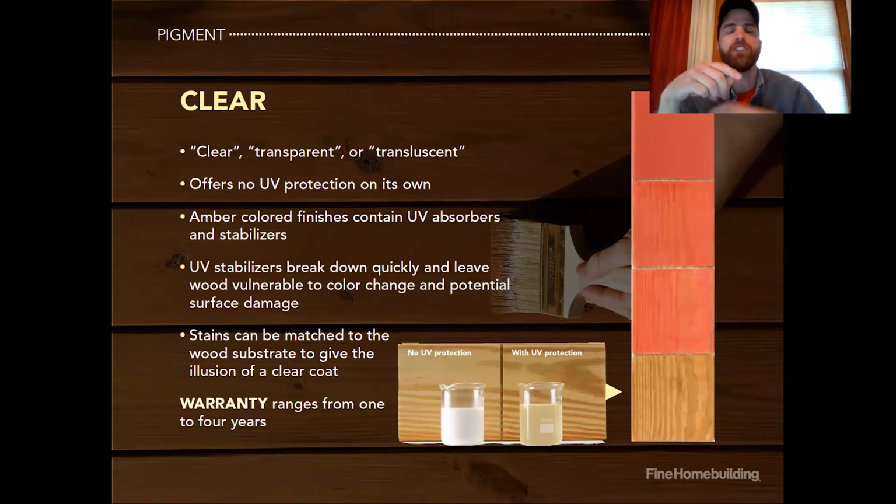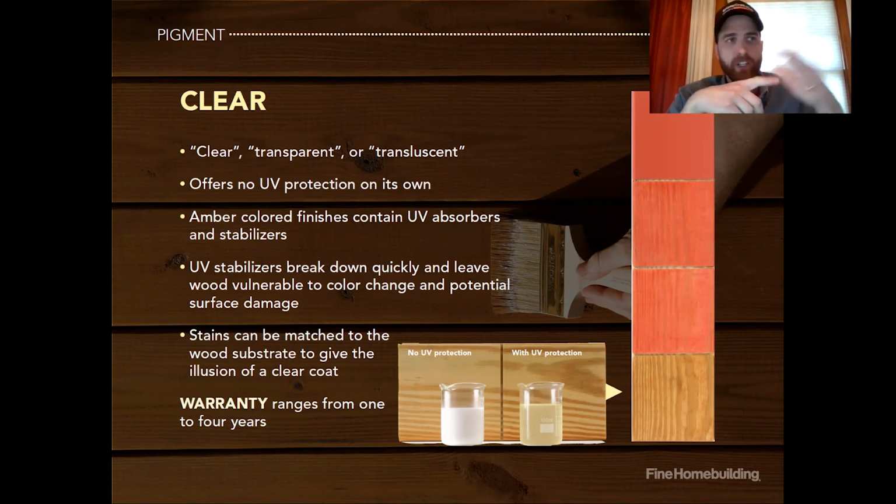So again, I mentioned no gutter downspouts pouring water under your deck. You don't want to have drainage from one part of your yard running down under your deck before it goes into the woods. You want to make sure you don't have grass and weeds and dirt. You want to make sure you have a couple of feet of separation.